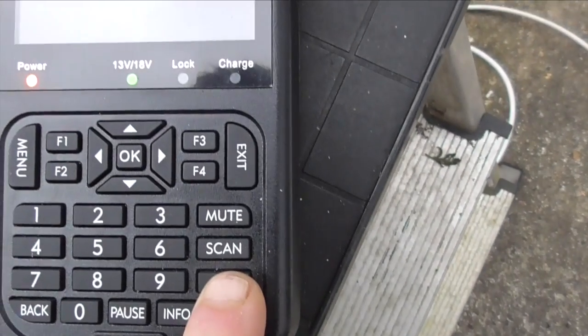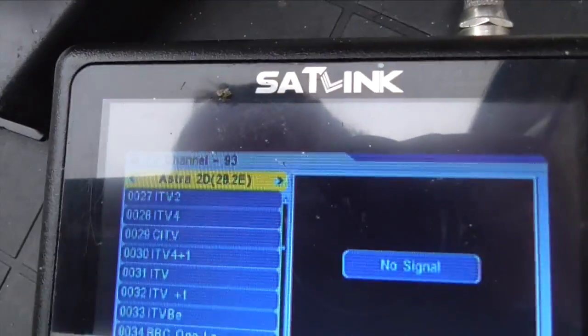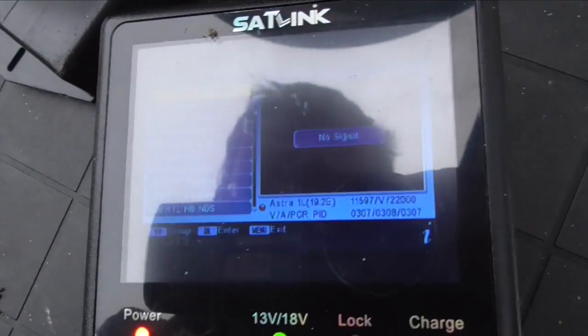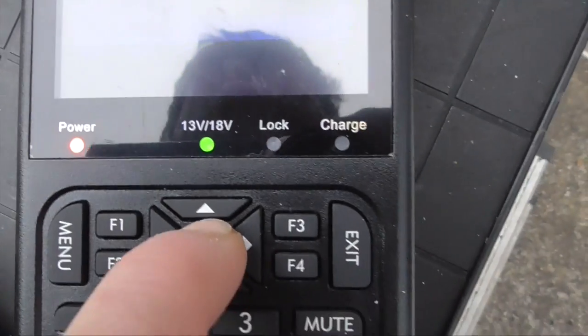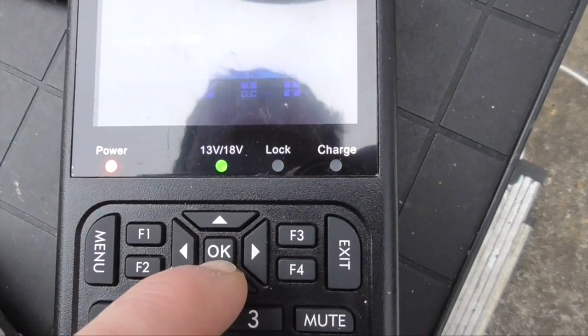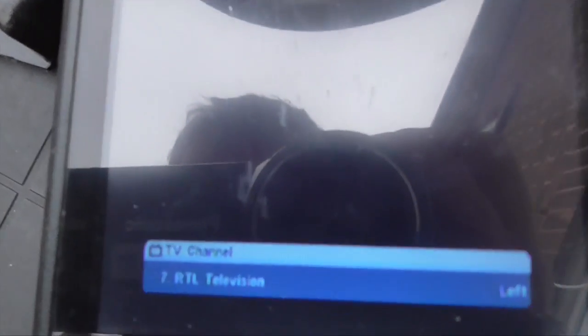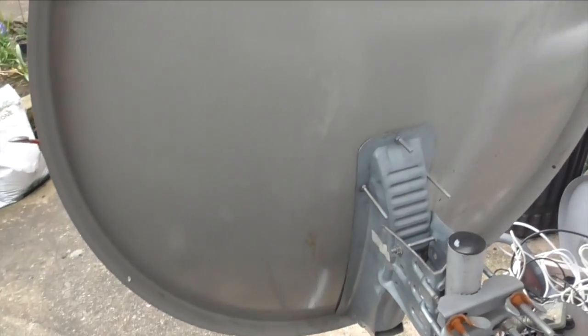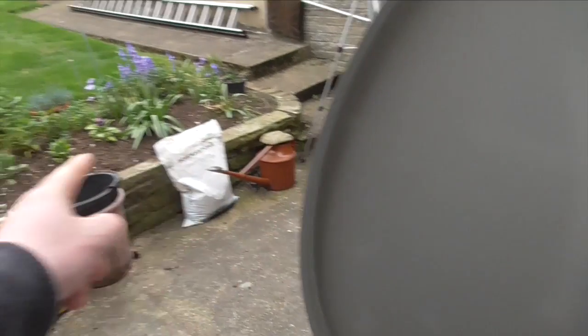Using the meter, we're going to switch it on — you can see me now, hello! On the meter we're going to push SAT and use the arrow keys to select a different satellite. I want Astra 1L. Then going down with the arrow keys and pushing OK, we go down to RTL Television and push OK again. It says RTL Television and shows no signal. Now I push F3 — you can hear the meter beeping, and when you hit the satellite the meter beeps faster. Let's move the dish across the garden and try to get a picture.